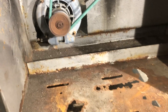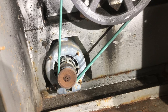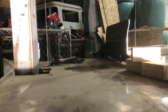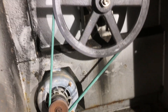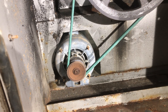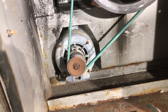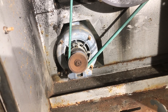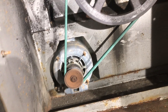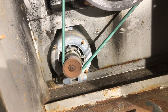One of the things I learned today was about the direction of the motor. The motor is supposed to go on this side, but when we did that it spun in the opposite direction, so the blade would not have been cutting meat in the right direction. What we did was take a grinder and simply ground out a hole in the wall, then drilled a couple new holes and mounted the motor on the other side. I had to find a shorter belt at the auto parts store and put it on there, and it works pretty good.